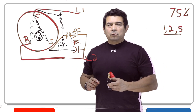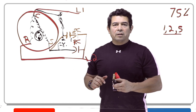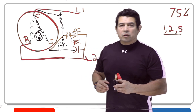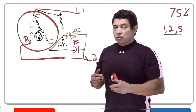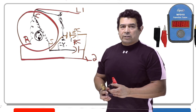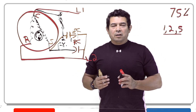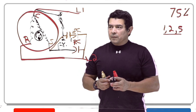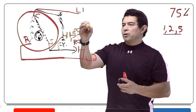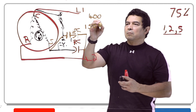This is what they call your potential relay, and on this one we're going to have two capacitors — the run capacitor and the start capacitor. If either of these two go bad, typically your motor is not going to stay running for long, or it may not even start. How do we test capacitors? With a capacitor tester — we must have a capacitor tester. One of the differences between a run capacitor and a start capacitor is that the start capacitor is going to be much, much higher in microfarads — I've seen them anywhere around 150 microfarads up to somewhere in the 400s microfarads.